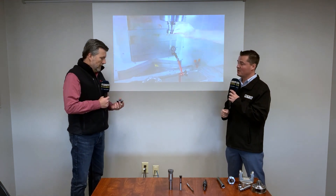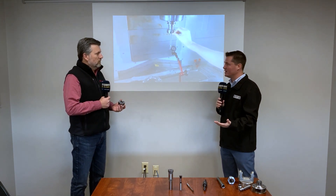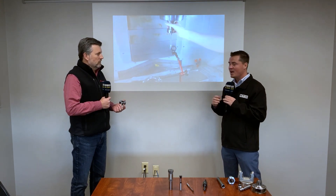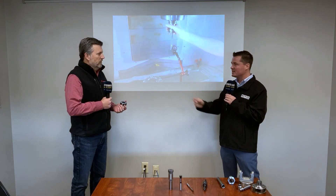When I think about small diameter tooling, if I don't have the precision, I'm breaking end mills and drills. When I think about larger diameter tooling, if I don't have the precision, I'm chipping it, wearing it away quicker, or I'm creating chatter in my part.